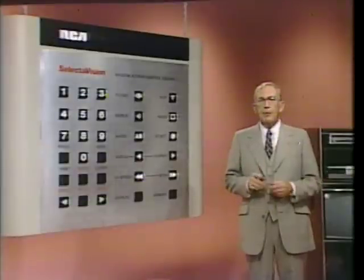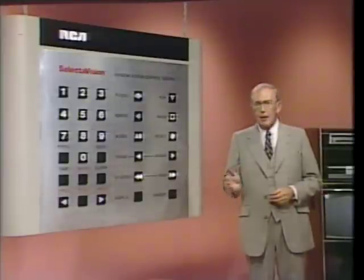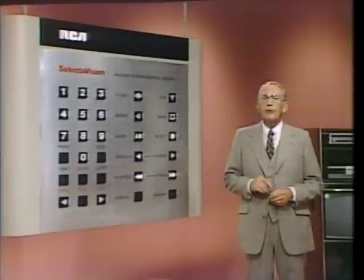We're now going to make a programmed time entry and a programmed band entry. These random access features are designed to let you begin playback at a certain point on the disc and predetermine where you want playback to end. For programmed time access, you enter both a start time and a stop time. You'll be able to use this feature with any CED disc. Those discs which have playtime information printed on the caddy label will be immediately accessible for automatic start-stop playback.